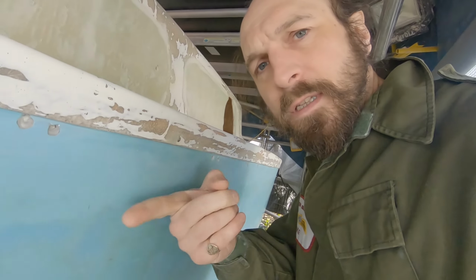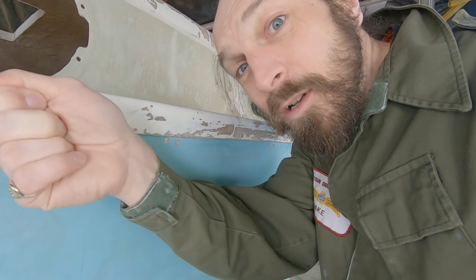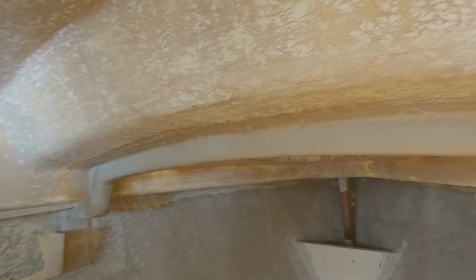Right, so yeah, that's what I'm doing then. So last week I did manage to, let me put the light on. I did manage to smooth those lockers around. The edges that I said I was going to do, where the junction of the deck is, you can't get the belt sander, not grinder I said last week, the belt sander into the very corner, so it was just using the Dremel to do that whole corner edge the entire way around the boat. And I did also, which just needs a bit of finishing, that beam.